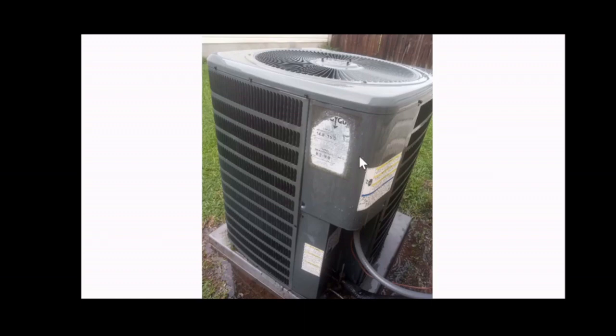Once you have replaced all of your parts, the unit should run. In my case, the unit was fine after replacing the capacitor and the board. I believe these parts may have been okay, and the relay on the inside unit may have been the main problem, but I went ahead and replaced those anyway because of the discoloration or burnt mark on that board, and just because the capacitor is usually one of the things that go bad on these units. So I went ahead and replaced it. That way it has a fresh new capacitor for years to come.